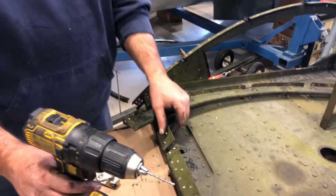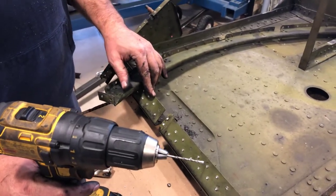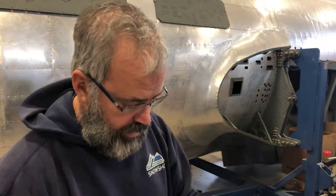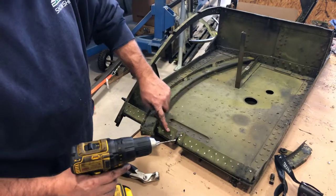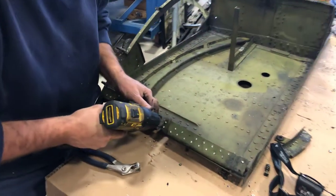It's not a real hard operation, just a lot of it. What we're doing is: first we drill through the head and then shear the head off with a chisel. Then we can typically get the parts separated. And now what I have to do is continue drilling these rivets out.